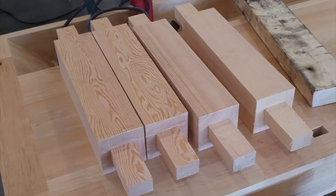When all those were done, I moved on to the cross pieces, which connect the two sides. These have large tenons on each side of a 3x3, and these were pretty difficult to hand-work. Each side required several cuts, and then I chiseled and pared it down to fit just right.